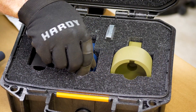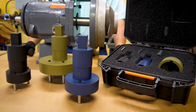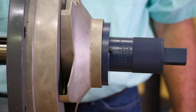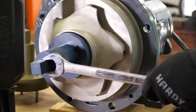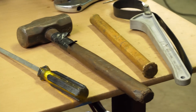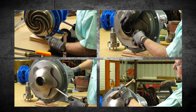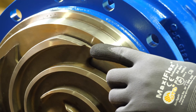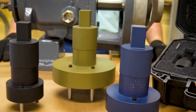Remove both wrenches, take off your input shaft socket and key — you're all done and there's been no damage to the critical components of the pump. The KEYRIS system provides the proper tool to safely disassemble and assemble your ANSI industrial pumps. It's specifically designed to distribute pressure evenly to the impeller, allowing even the tightest fitting impellers to be removed without damage. No longer will machinists need to use inferior tools which can cause damage and distort the impeller or pump shaft — damaging these critical components leads to imbalance and vibration issues, causing premature pump failure. The KEYRIS system is the right tool for your job: it's safer, easier, and cost-effective.